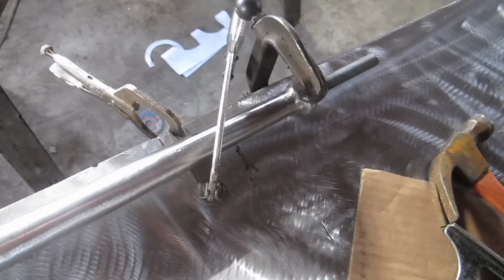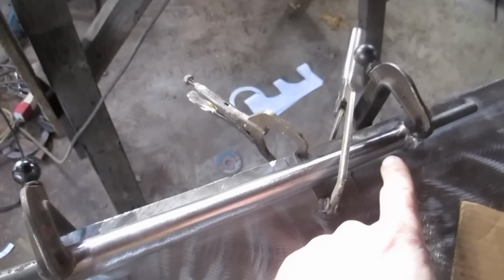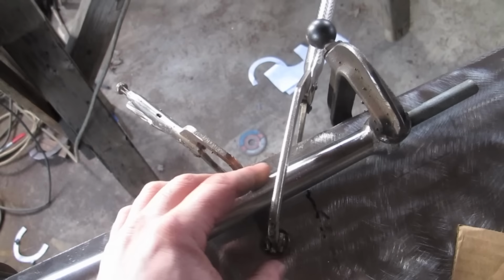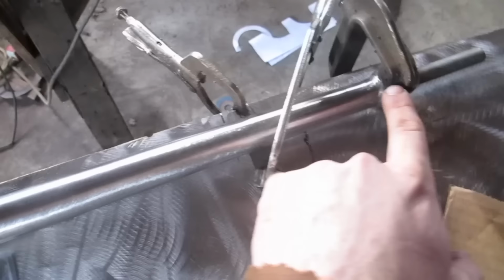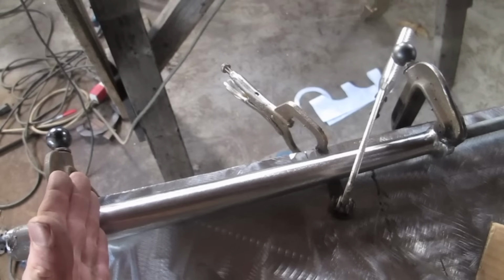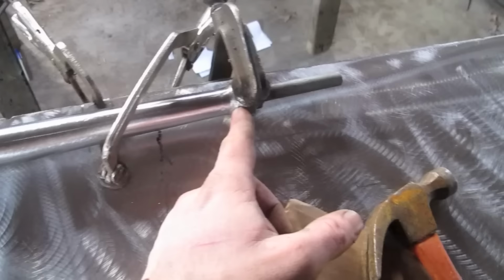One of the things I was worried about doing this is, now that it's tapered, centering the handle and making sure it's lined up properly with the blade. So this bit at the end is still the original diameter, and this bit here where I'm going to chop it off is the original diameter. So I'm going to insert this thing. I just found a piece of 1/8 inch, shoved it under, and then slid it along till it was making contact with the bar. And these two are clamped down, so you tack here. And all of a sudden, this thing now keeps it floating at that original height. So, tack it here, cut it off there, cut off this nubby bit so I can attach the pommel.